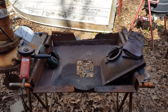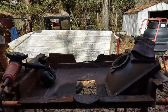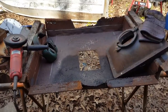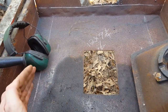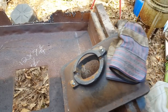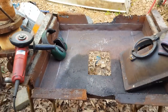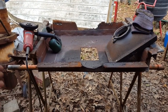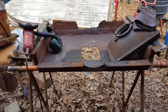This is what I'm making the new coal forge out of — an old sheet metal basin of a coal forge that was in the shop here that I'm salvaging. I'm chopping this down so that once I cut it out and fold the sides up to be about 2 inches tall, this is going to be 18 by 24 inches. It's going to fit the fire pot I got from Laurel Machine and Foundry. I'm chopping off all the extra — the quarter angle, tube, and everything — and I'm going to build an entirely new frame that I can disassemble completely for traveling.